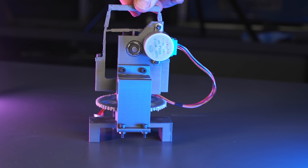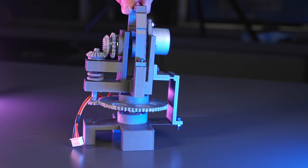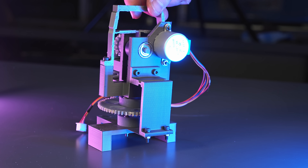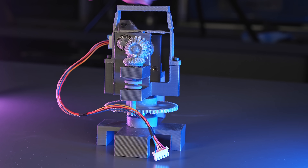This is needed because everything is just sitting on this ball screw, and the motor is on top of the actuator. So if you were to just run it without any kind of stabilizer, it would just spin in place — you wouldn't actually get any lateral motion. So the torsional stabilizer is just a flexure joint on the back that allows the whole thing to stretch in a linear direction, but not twist.